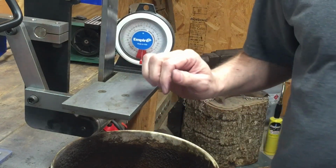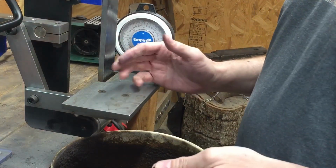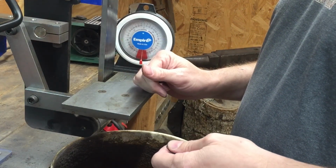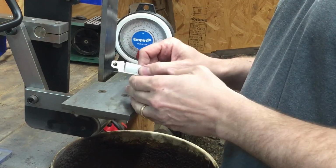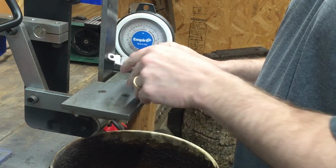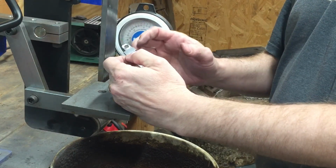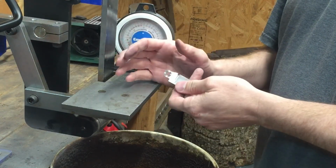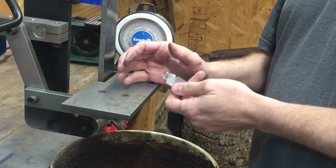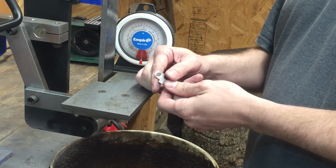And then also on your drill press, just try to make sure that everything is. And I guess it would depend on your drill press, the way you'd have to dress it. But make sure that your holes are perpendicular. And then make sure you have the right size drill bits. And so I think these things taken together probably all contribute a little bit to the issue that he was having. Now, what is the solution?